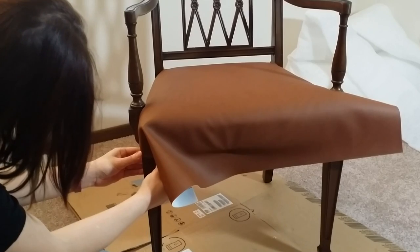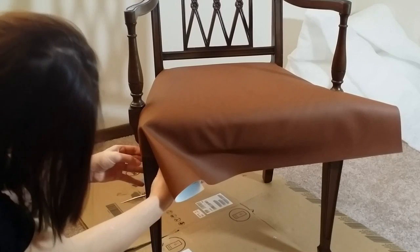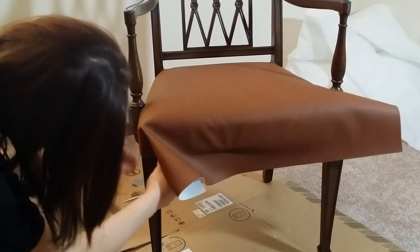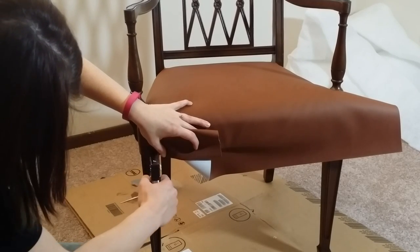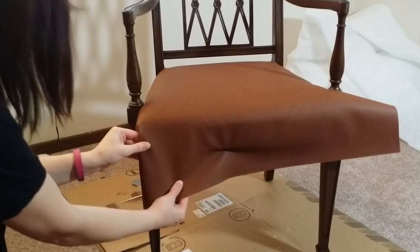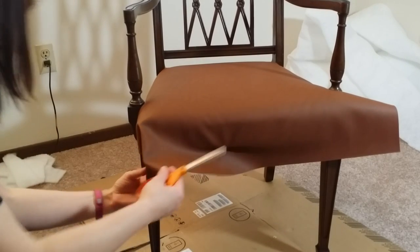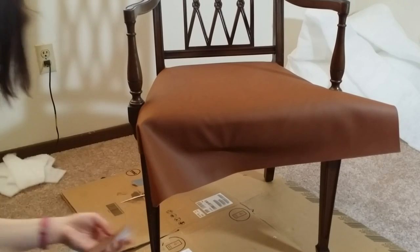First I wrapped around the side, and you want to make sure the bottom is flush even with the top of the finish on the chair — you don't want a gap where the leg is finished and where it drops off to the upholstery, because there's a big difference in material quality. I just rolled it under and stapled it on the front, because in this case I wrapped it around the front and then the top piece is going to come and cover that. Measuring might have saved a little extra material, but this way is quicker.